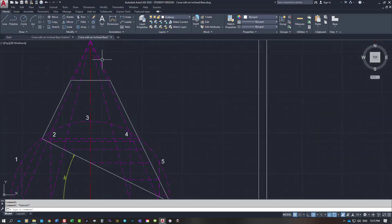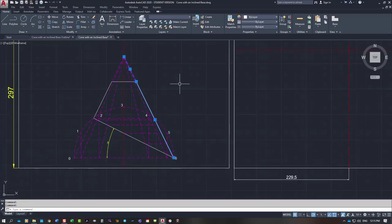So what we want is this length all the way down this outside edge here, from the apex right to the very base. This is what we're going to scribe our arc with. So what I'm going to do is a distance on it. And from there down to there, you can see that it's 222.49. I would suggest you draw it at 222 or 223. Your call on that. You might be able to set your dividers to 222.5, give it your best shot.